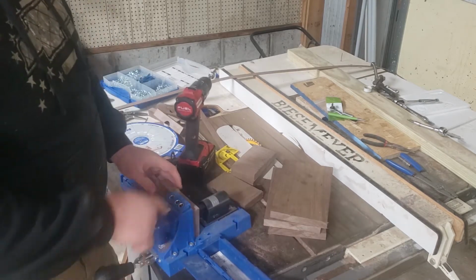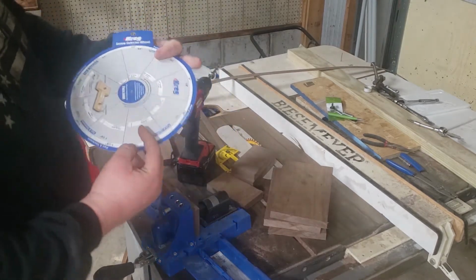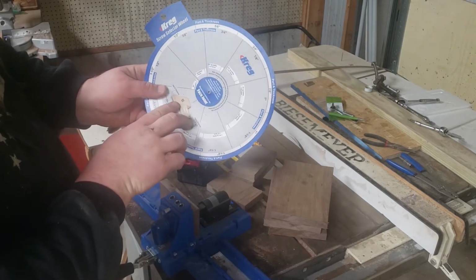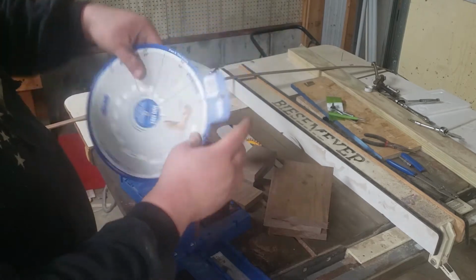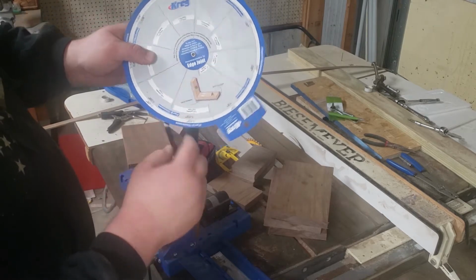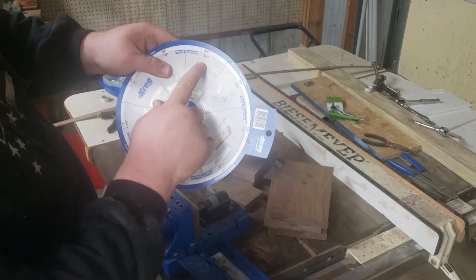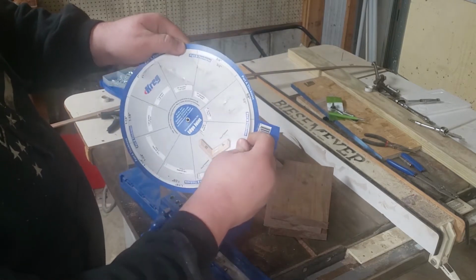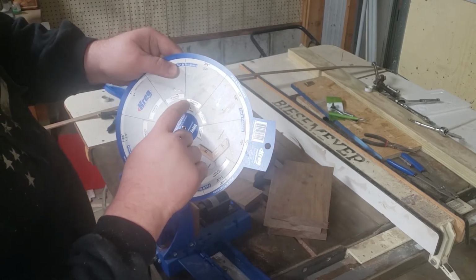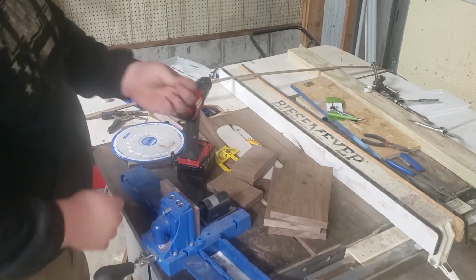You clamp that in there, and you just drill right down through here. And here is your thickness guide that comes from Kreg. You can see if you're fastening the two boards this way, you're going to use this side. This side, you go A and B, you're going this way, so I'm going to use this side here. And both boards are 3/4 inches, so 3/4 and 3/4, it's like a slide scale. So as it's set up there, it shows me I'm using the 3/4 inch jig setting, along with the 1 1/4 screw, which will be this guy right here.